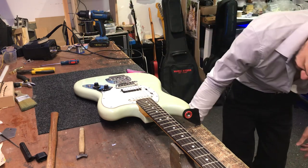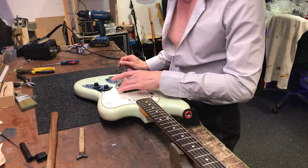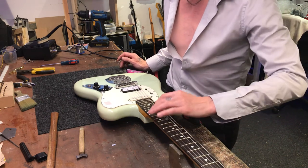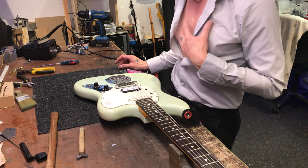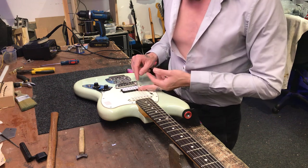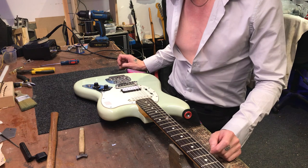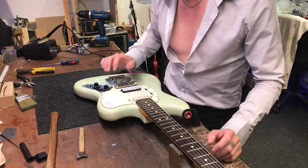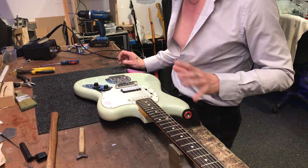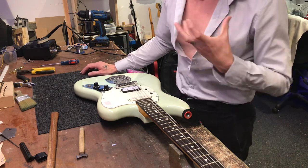I made it quite a few years ago because the stock one that comes with it — I think that's an Alnico — wasn't quite right. Ryan wants something a little different between each instrument. The humbucker on the red one is a DiMarzio Super Distortion, but we're now discussing swapping that out for something of a Toltec custom design, something a little less compressed and hot. This one is quite hot at 15.3k — we're pushing into Duncan JB territory, which I think is maybe in the 16k range. That's roughly what we're going for, as opposed to the ceramic 13k Super Distortions in the rest. We're talking about swapping those out for something more PAF-style, traditional, not as compressed.